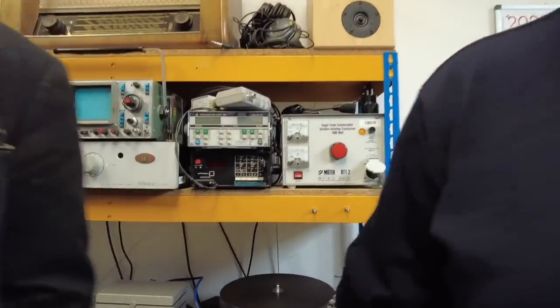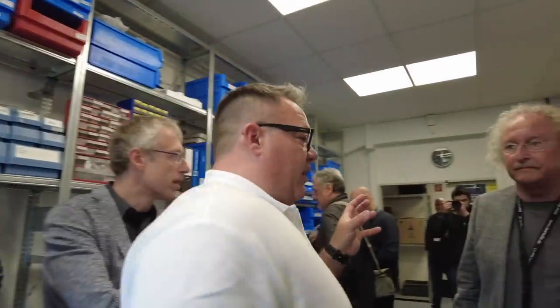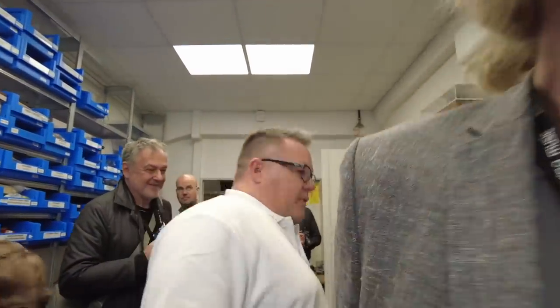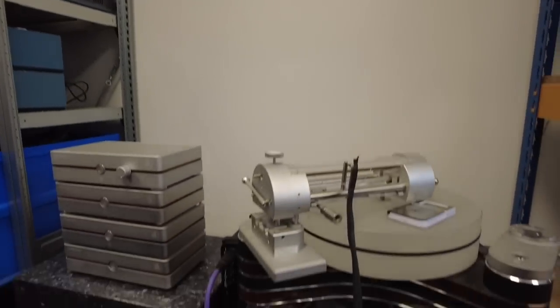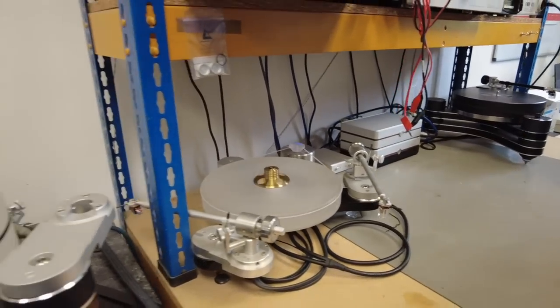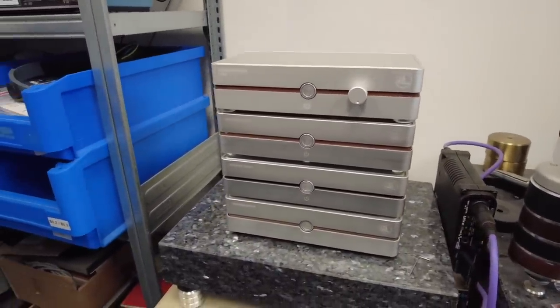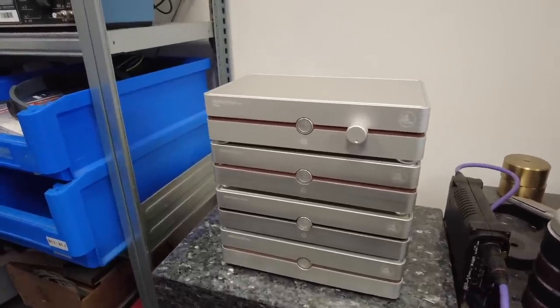So in the other room, you can have a quick look. I think you're currently preparing smart powers. Yeah. Smart power. These are battery powered supplies for turntables, which are getting more and more important, because when you have a household with a lot of computers and switching power supplies, it's a total disaster. Ooh la la. Oof. Or if you have this Devolo power LAN. We had a customer who called us: your turntable is humming suddenly. And we said, okay, so it goes back and forward, and it's difficult to say from far away. So now the first question is, what did you change? Do you have a new router or a new Wi-Fi? Yes, I have a new Wi-Fi. Switch it off. Oh, the hum is gone. Yeah, now you know where your problem is.